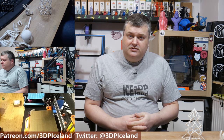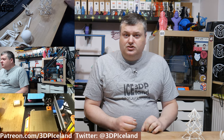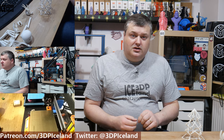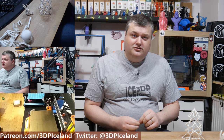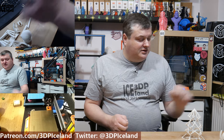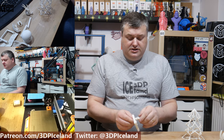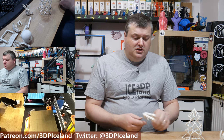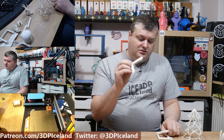I was really happy with this filament — it performed really well and was very easy to print on my Prusa machine. No stringing, pretty good layer adhesion, and excellent strength overall. I broke apart some test prints to check strength, and like the Banshee model, it was quite difficult to break apart. For mechanical use like the Christmas light brackets on the balcony, this is a perfect use case — ASA is good for outdoor use and mechanical parts.